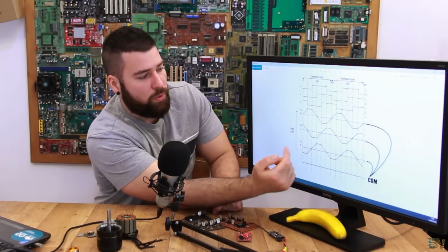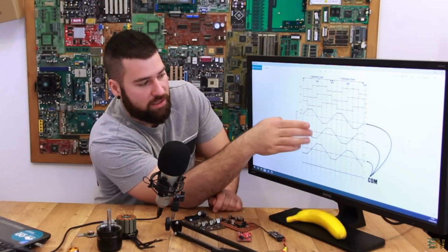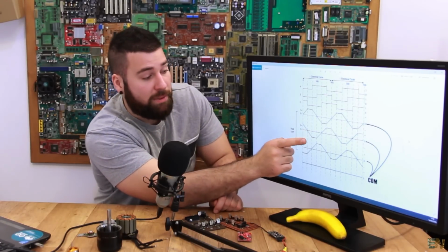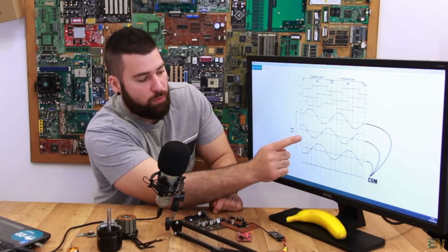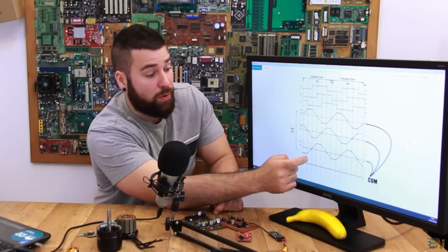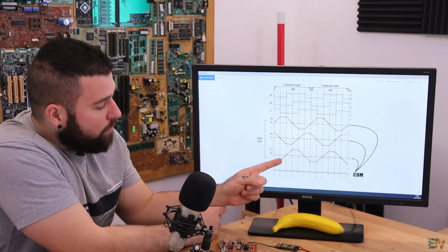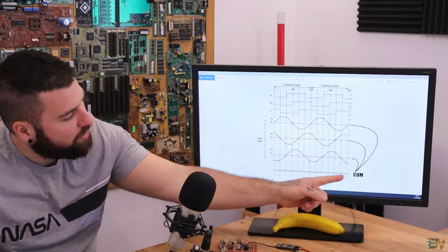In the next step, what do we have? We have a +1, because this is fully 1, this is fully positive, and then we have a falling ramp, but on the negative side, and also a rising ramp on the negative side. So one falling ramp on the negative with another rising ramp on the negative will give us -1. If we make -1 +1, we get another time the 0. And that will be our COM value.